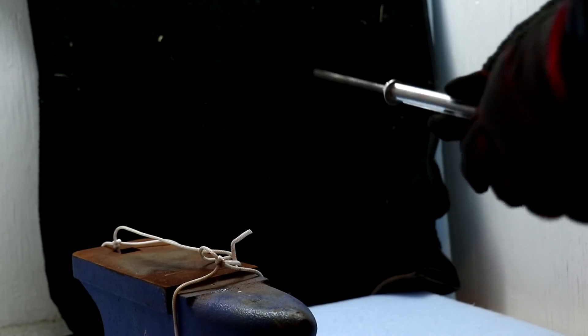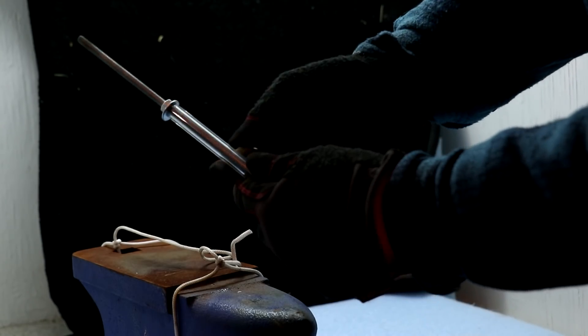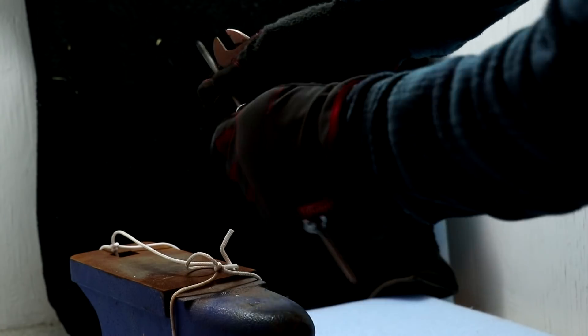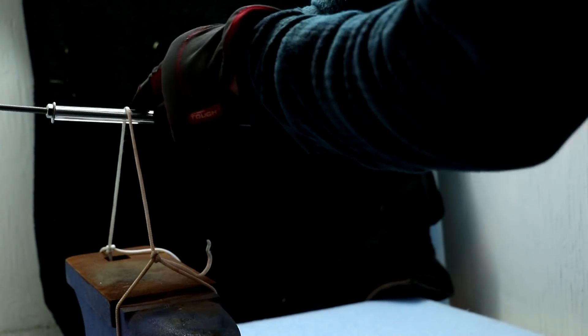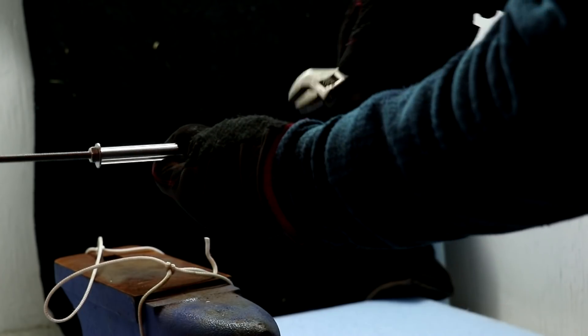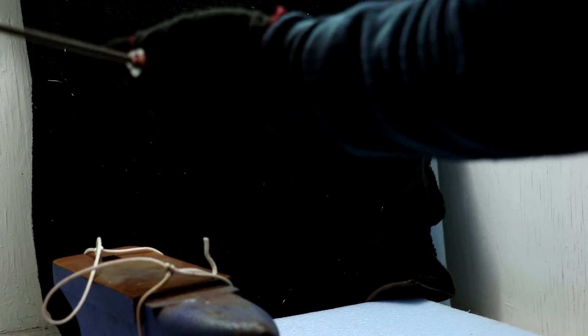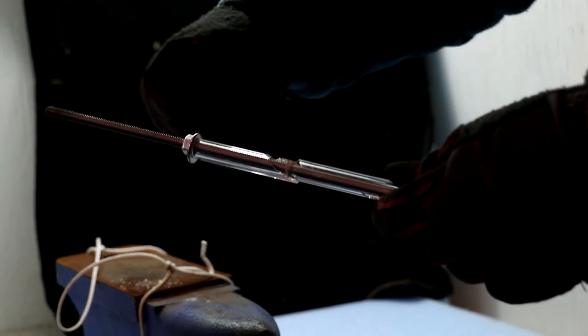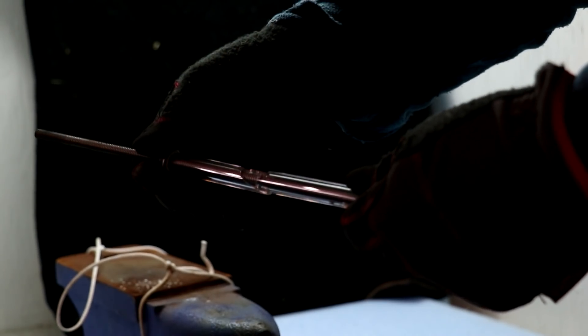Now let's do the same thing again. But this time, I'm going to scratch my piece of glass. Now I'm going to tighten these nuts so that the metal bar running through the glass tube is under tension, and the glass is under compression. Now let's see what happens when I put this on here. The string is on the side opposite the crack, just like before. I can lift this up — no problem, the glass is able to withstand. Now let's do the same thing, but I'm going to loosen this nut first. So now the glass is no longer under compression. Exactly the same — and the glass breaks. The compression held the glass together so that those cracks could not propagate.